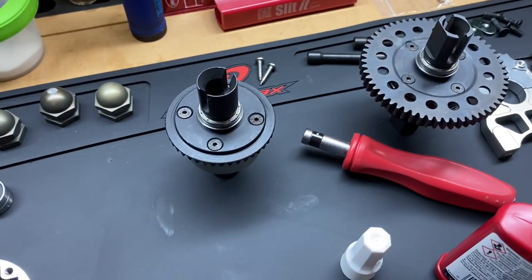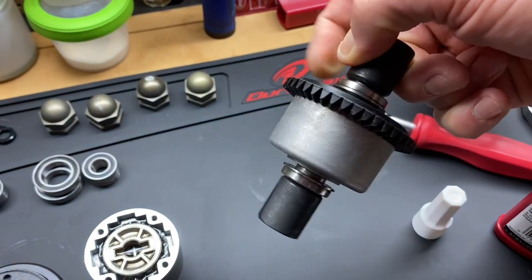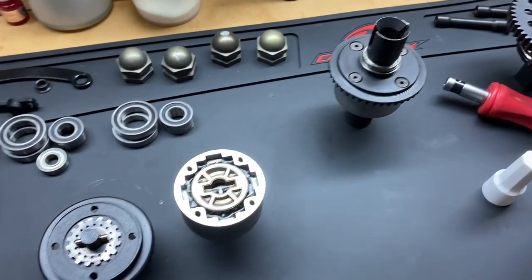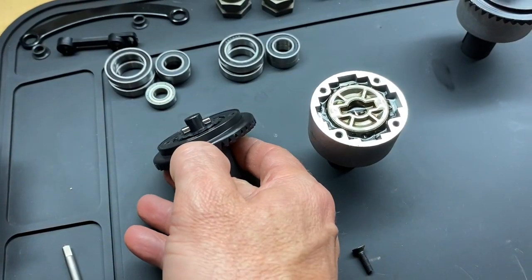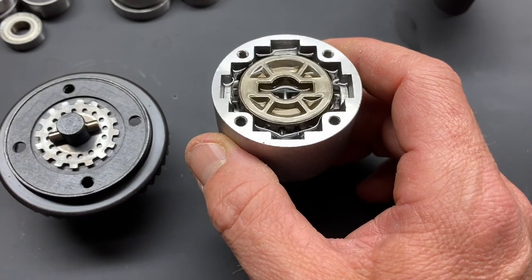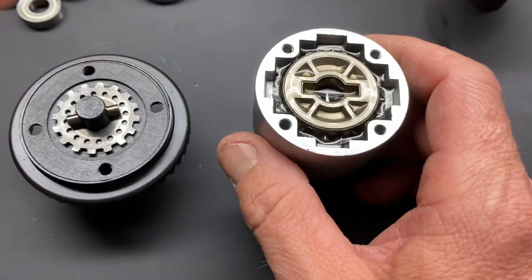Here are my diffs — I got these two back together, the front and the center. How you can tell the front: the front always has the gear towards the inside of the case, and the rear always has the gear facing the outside of the case.